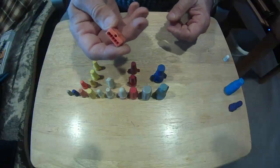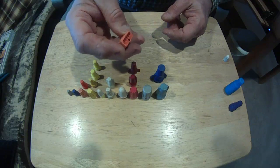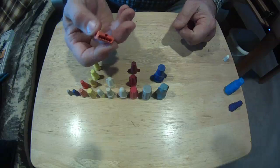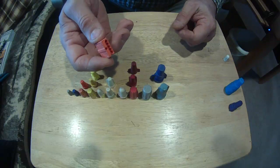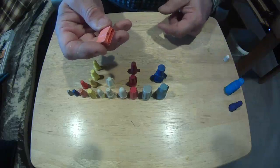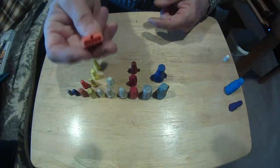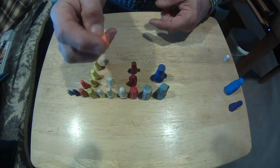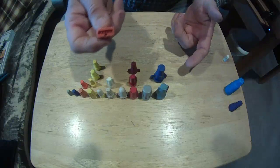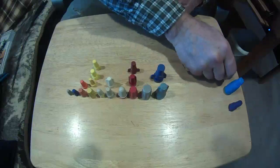This is something new on the market. I personally don't like them. You just strip the wire and stick them in, and it's a stab connection just like the outlets have. It's not a very good connection if you've got a heavy draw on it. It loosens up the spring connection. It's quicker, but we've had many failures with these. So I don't trust them a whole lot. If you had something like a recessed can where the draw is very minimal, they would probably be fine.